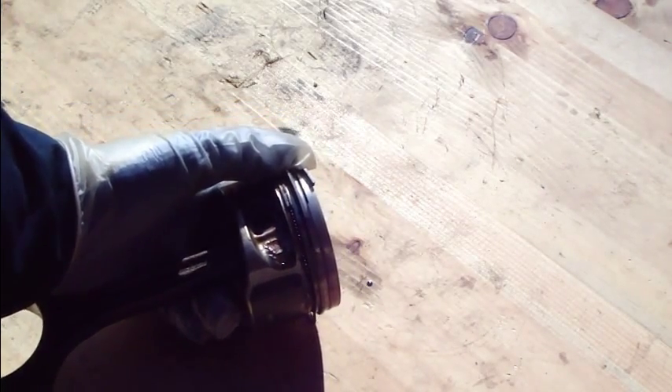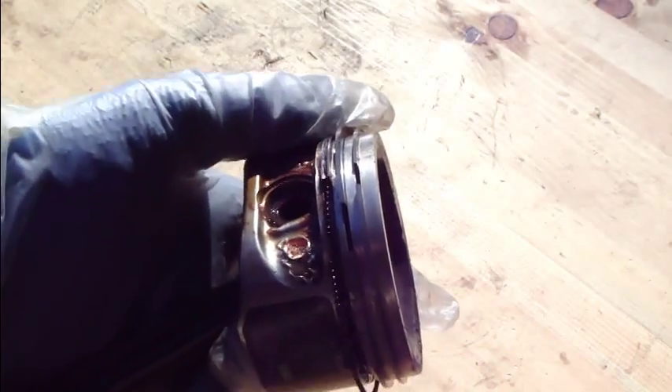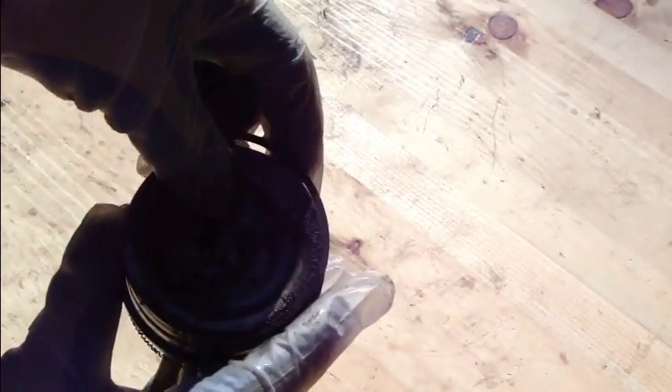This is how the ring looks at this point — this is the first step. Always keep your finger there so it doesn't drop back into the groove. I insert my thumb and lift the ring up again — sometimes it can be a little bit oily. Now it's there. I carefully move it, keeping my thumb in place, then rotate the ring carefully. In that position it comes nicely out of the groove.